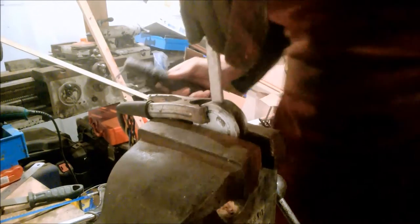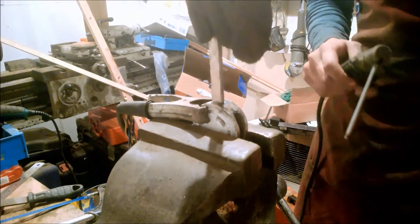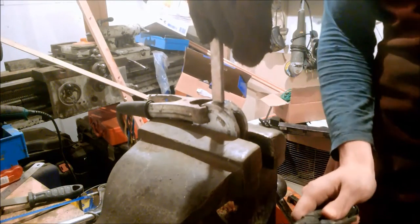Incidentally, the circular part was cut in half sideways, had a slot ground into it, and was then welded back together. I did not feel like trying to forge a hole through a bar that wide, so I took a simple route.